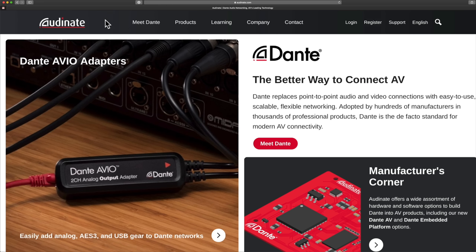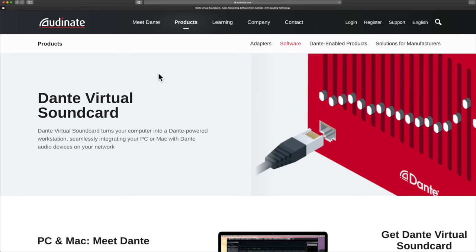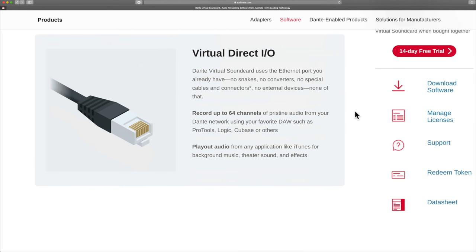The control room will have a digital audio workstation on a computer — how do you get audio out of that onto a Dante network? Audinate, the company that makes Dante, also has an app called Virtual Soundcard which essentially makes your computer another Dante device on the network, so you can send and receive channels of digital audio from your DAW to any other Dante enabled device on the network. That opens up a ton of different possibilities, and the major advantage is you only have to run one cable out into the studio space.